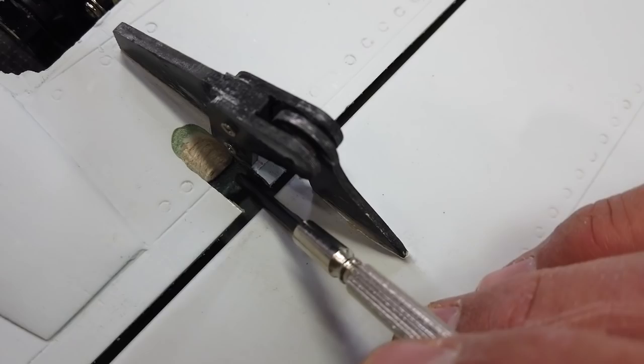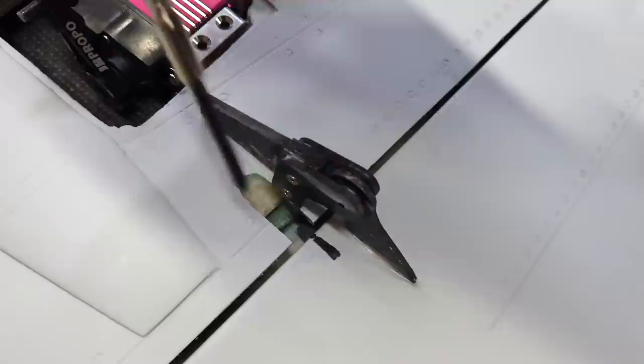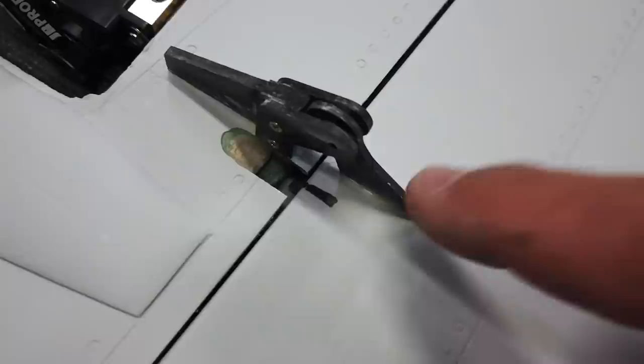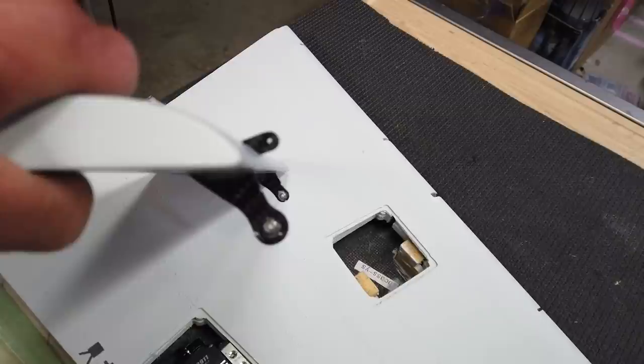The slot for the control arm in the wing is done. This hinge piece is all supported by plywood, and the angle of the control arm works really well with that indent — really well with the placement of the carbon hinge point. The benefit of having the horn at that angle is that mechanically it gives you a great angle with the servo and you're going to get a lot of force.